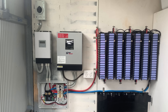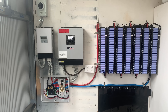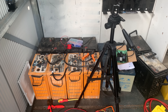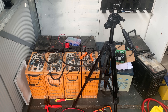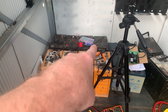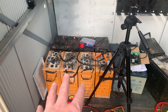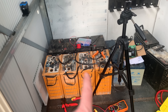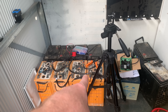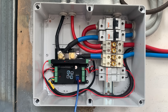That's a mighty good use of some 18650 batteries right there. They were just sitting in my shed, unused, so it made sense to bring them out here. We now have 10 kilowatt hours of storage — a big increase on that old battery bank. Even those 880 amp hour lead-acid batteries — those four there, that bank and then that bank — I reckon it was only giving him about 3 kilowatt hours per night, and it should have been 10 or 15. So they have well and truly done their day. I have to thank them for their service. They're probably going to go to a recycle yard. That is all commissioned up and all working.